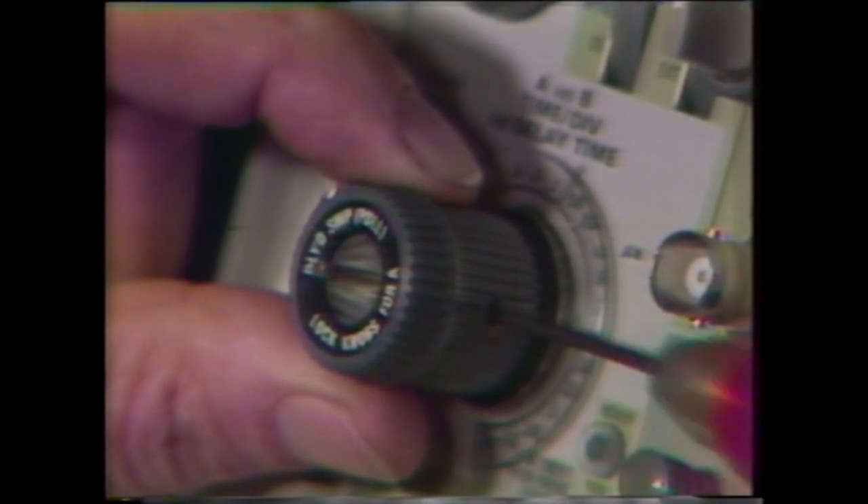If necessary, adjust the A knob by loosening the set screws on the back of the knob. Before replacing the B knob, turn the B cam switch and the A knob fully counterclockwise. Put the B knob on the cam switch and allow about a fingernail's width of clearance between the B and A knobs. Tighten the first set screw and check for positive detent action. Then turn the knob to a position where the second set screw can be tightened. Make sure the knobs will separate and work independently, then replace the variable knob and tighten the set screw.